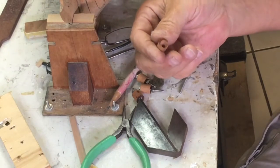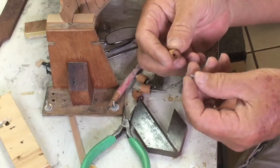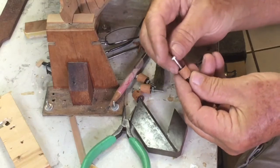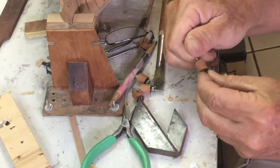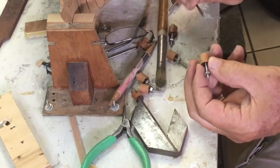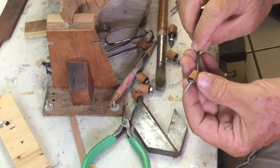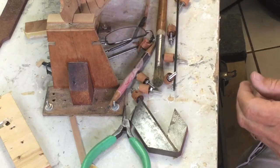Here is how we make it up. This piece is going to become the new head of the screw. On one side there's a hole big enough to take the nut; on the other side, the hole is big enough to take the head. We drill it through by the thickness of the bolt. To assemble it, we simply push the bolt into the piece of wood and attach the nut. Then we put some epoxy in and push that in, then just tighten up the nut. We've got it all the way inside, with epoxy in this hole as well. You tighten it up, the epoxy will come out of the top, and then you get one of these.